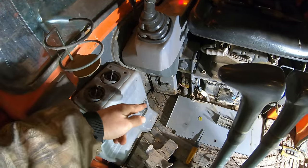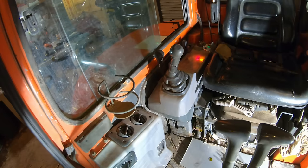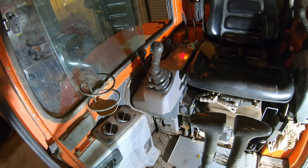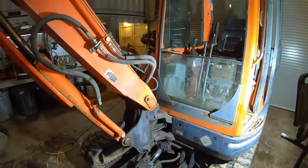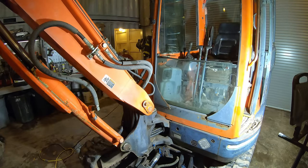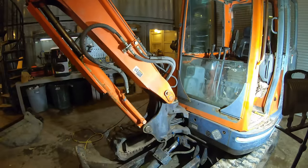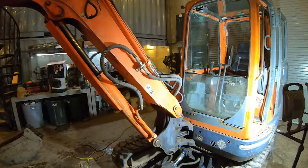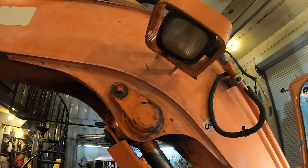Use a fog light like that in place of your fuse, because you can go messing with all the wires on the thing and find the one that's shorting to ground. Now, if you're working on an old piece of junk and the wiring harness is completely chewed up in it, sometimes you're better off just running brand new wires, because that would be a much faster repair. Just do a good job routing them. Try to route them the way the factory routed them. Make it look neat. All right, so let's take this apart and see what actually happened to it.